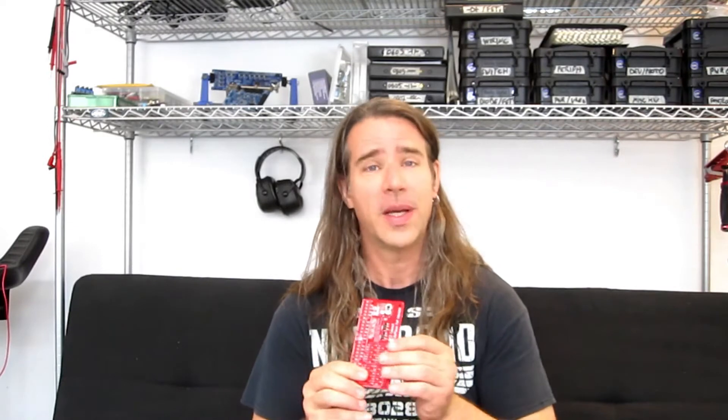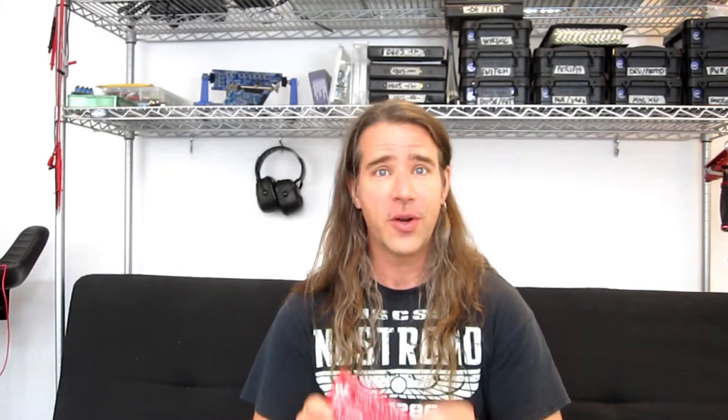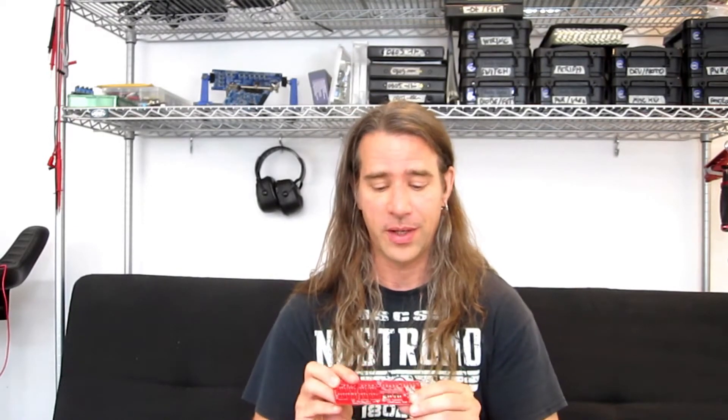Same shirt, different day — I got the boards populated. Everything I have left, as you can see, there are about 20 components on here. If you're making your own, it's not a big deal. The only ones that are required are really the FETs and the snubber diodes, but I like to have the LEDs and some bypass caps here to smooth things out. If you're doing your own or if you get one of the giveaways, you're still going to have to put in all the through-hole components, and there will be a ton of instructions in the link below.